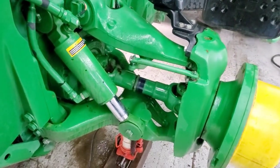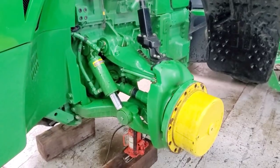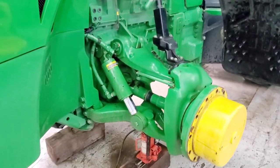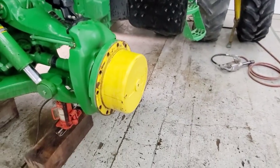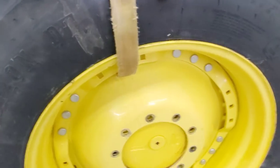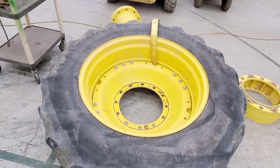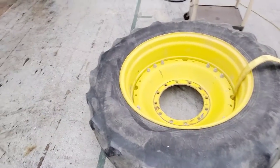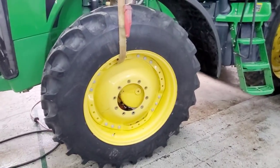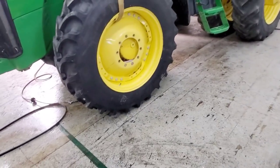I believe there were 12 grease zerks on this one side for the ILS — Independent Link Suspension is what it's called. It's worth it though, because boy, it sure improves the ride of the tractor and helps make sure you don't get any power hopping and the tires stay on the ground. Anyway, new tire going on there now. Nevermind — new plan. Apparently the hubs are a different diameter. I had no idea. The hole in the center of the rim is bigger on the inside tire than it is on the outside tire. The dish and the pattern all look the same. Yeah, that's not going to work. I guess I'm not going to put those tires on and have it all back together for tomorrow. So I'll put that one back where I found it, put this one back on, and we'll just wait.